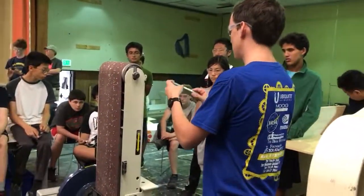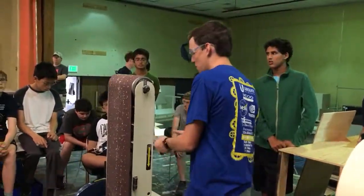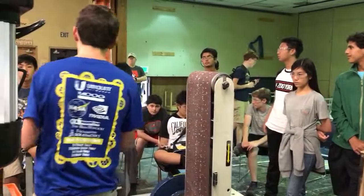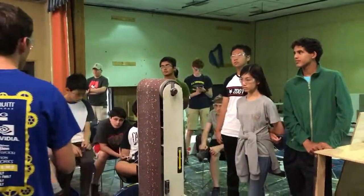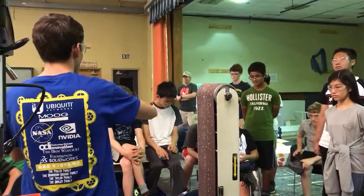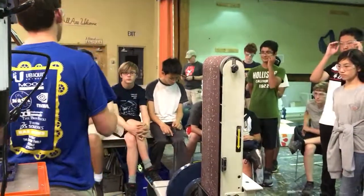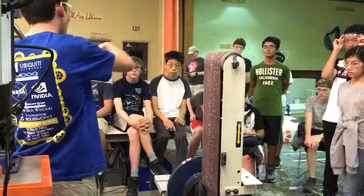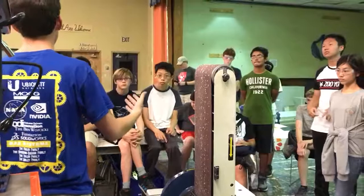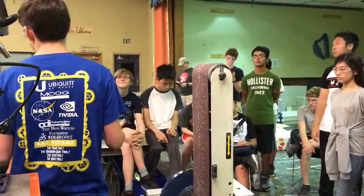Yeah, so you guys can see pretty quickly how to drill a hole. If you want to do this precisely, you would use the scribe, you would mark the location, get a center punch, a tiny needle, it's like a hammer extension, a steel pointer. You put it on, you hammer it, then you have a tiny dot. The drill bit would try and glide into the dot, and then you'd be able to drill like that. Are there any questions? And then use the drill press.